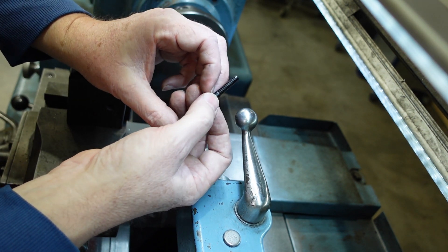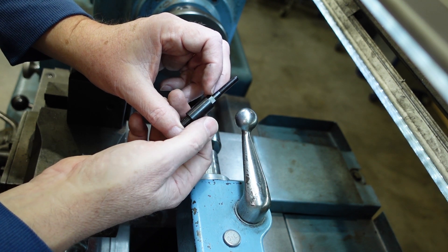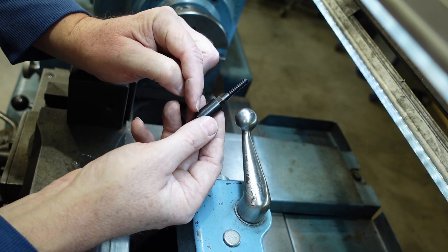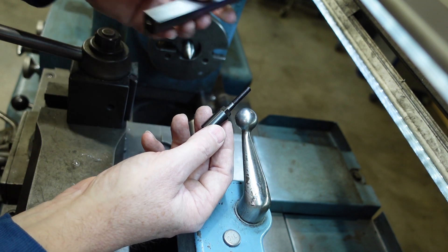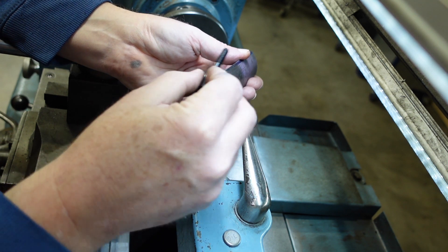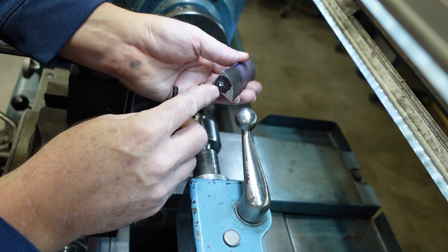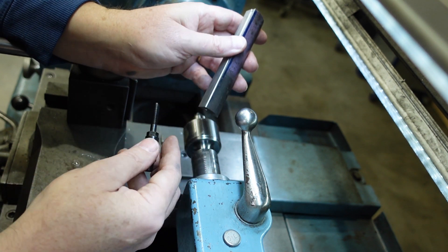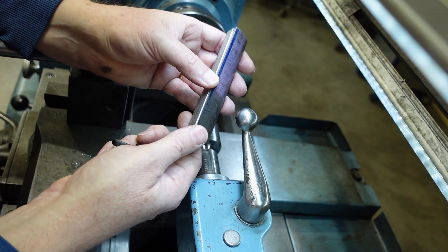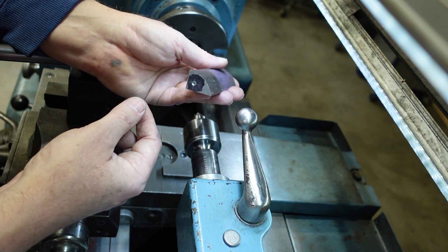For this part I need a bit of 13mm diameter material. I could use some mystery metal but this needs to be reasonably strong, and it's also got a left hand thread on it too, just to make things interesting. So I've got a piece of EN25. Now this piece isn't actually the right shape to put into a chuck - it's the offcut of a larger bar, I needed some squarish pieces so I cut those out. So what I'm going to do is I've put some centres on either end, I'm now going to turn it between centres and just round it up.